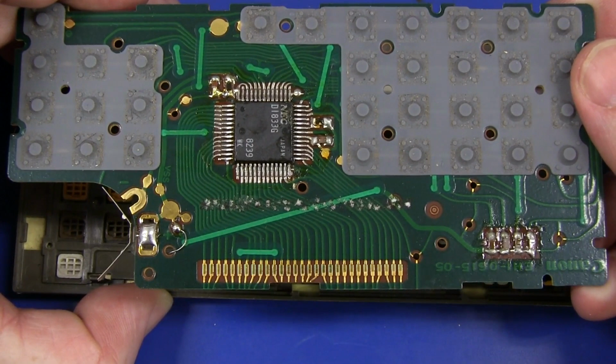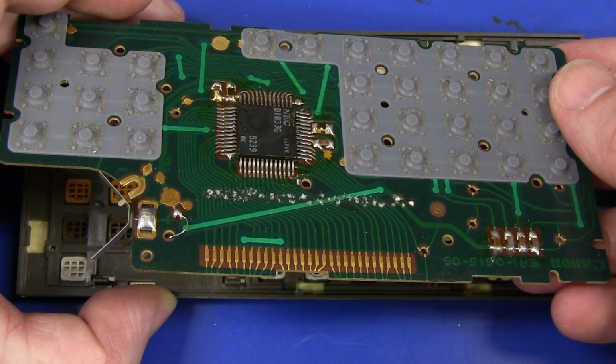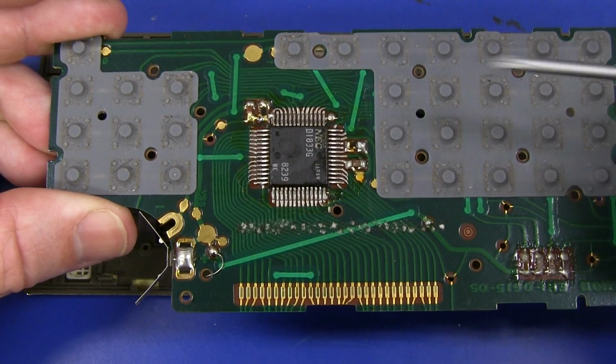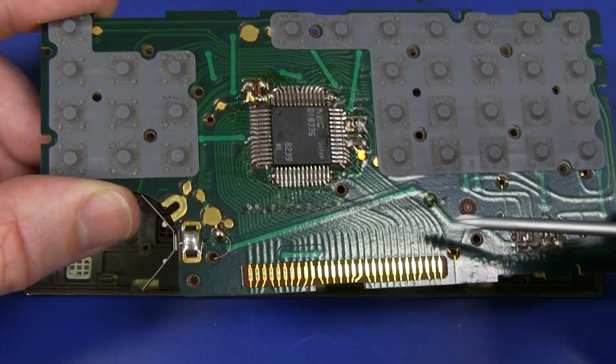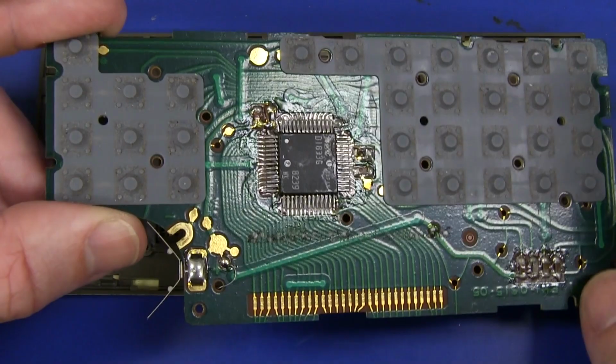It's a squished quad flat pack. One of those leads, not the regular J lead type, but just the ones coming straight out. I can't remember offhand the name for that. But there you go. Look, check it out. They've got some extra traces jumping across here, like jumper links. They've got their double-sided board, but they haven't actually used it. If you get the correct angle of the light, you can see that they've adhesived that on as a separate step afterwards. Jeez, you don't see that very often.